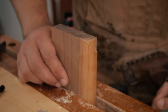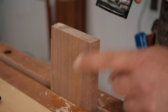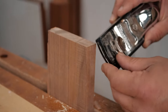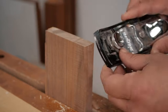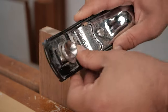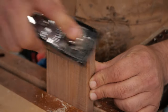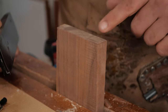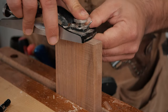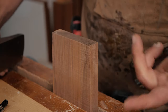So here's my trick, and it's a very simple one. I'm going to show you two ways to do this. First, you want to do one stroke across the long grain — a chamfer — in the direction you're going to be planing. I like to do it at an angle upward because that keeps this corner from tearing out. Basically, I do one chamfer stroke for every stroke I'm going to do this way. Watch — and we've done five, which is how many we did over here, and you can see we got absolutely no tear out. So you want to do across your end grain first before you ever plane. This plane isn't even very sharp right now, but you can see I'm getting no tear out.